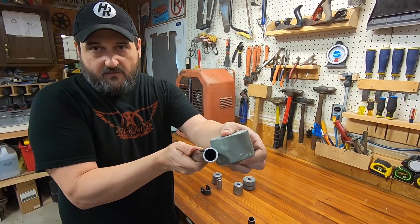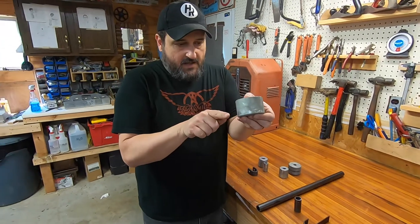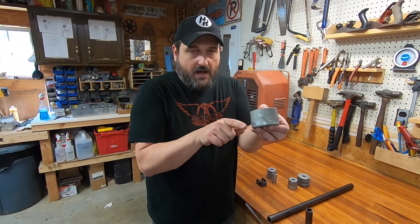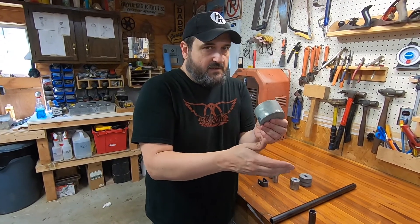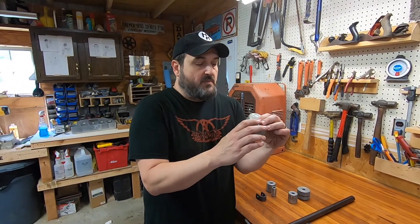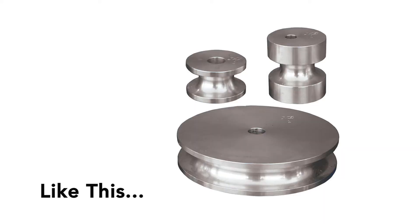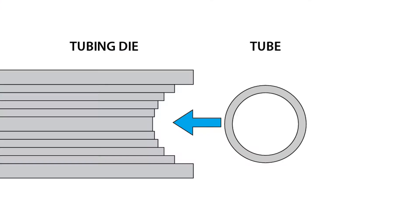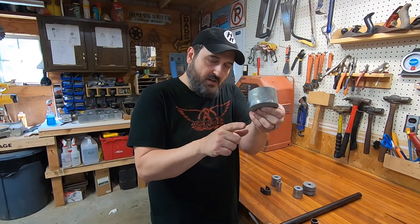This does not jive with this. We needed to make a die that had a concave notch cut out of it. The problem is, tubing benders themselves are not terribly expensive, but the dies are crazy expensive. We wanted to experiment with making one on the plasma cutter — rather than have one giant chunk of steel machined to the right shape, I wanted to experiment with cutting a bunch of thin layers of steel in different diameters to give us the radius that we want.